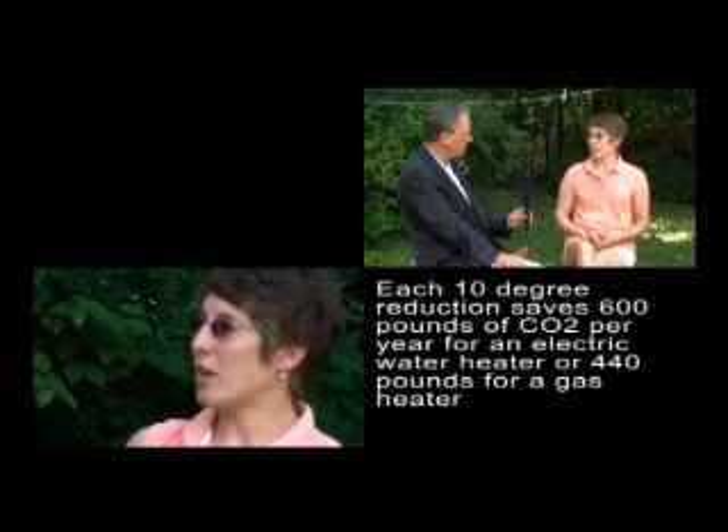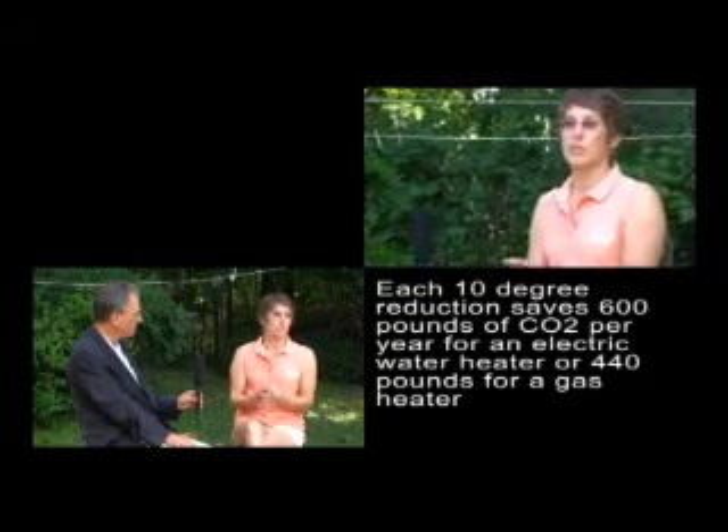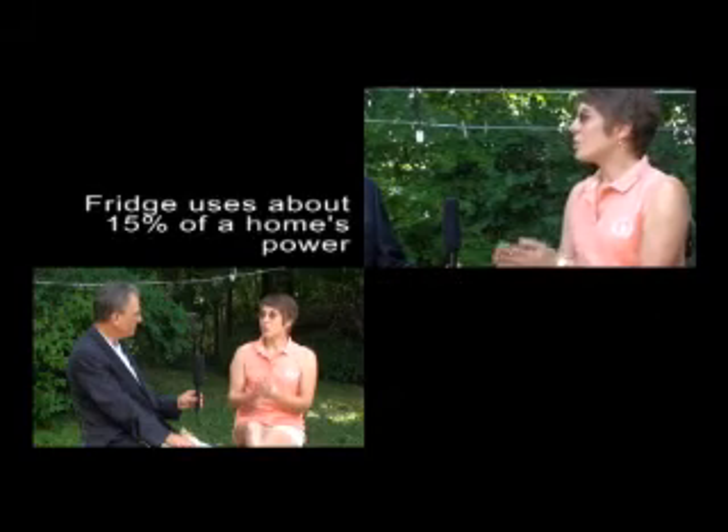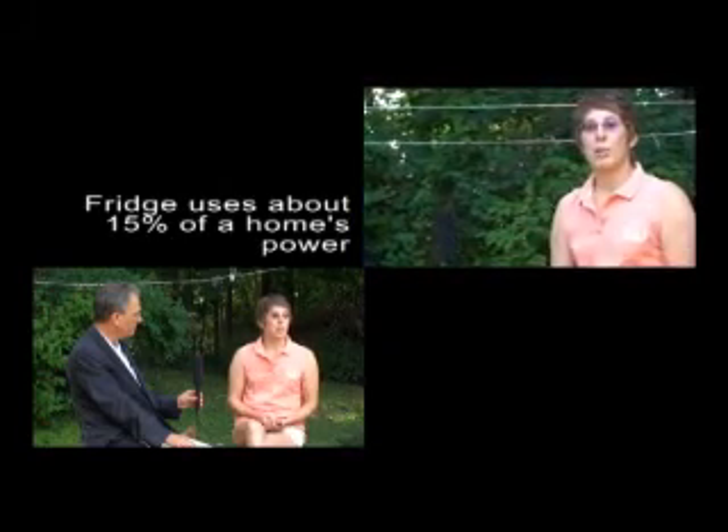For those of you who may not have bought an older home in an inner ring suburb, there's definitely a lot that can be done on a newer home in a suburban area. Very small things make a huge difference. If you can adjust your thermostat a little bit cooler in the winter and a little bit warmer in the summer, that will save you dramatically on your energy bills. As far as hot water use, adjust the thermostat on your hot water heater down. Most of the time it's set to 140 degrees, which is far warmer than most people need. If you drop that 20 degrees to 120 degrees, you'll see the savings in a month. Make sure your refrigerator is away from the wall and dust the coils once in a while. When purchasing an appliance, look into Energy Star appliances — they may cost a little more up front, but you'll see a reduction in monthly energy bills for the life of that appliance, and oftentimes that will pay back many times over.